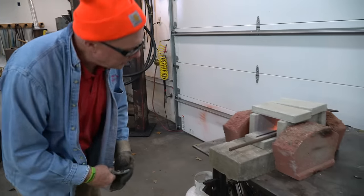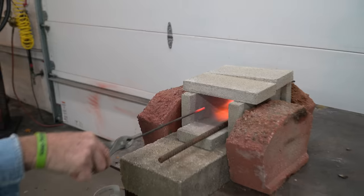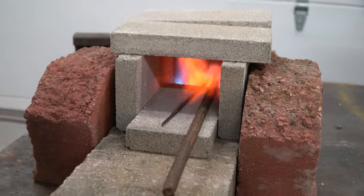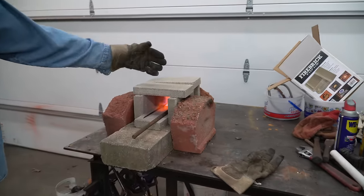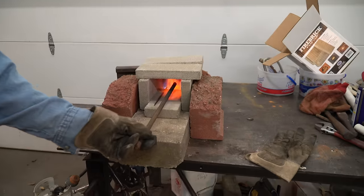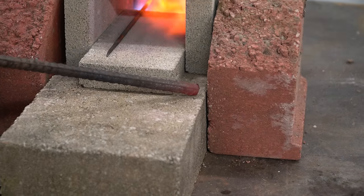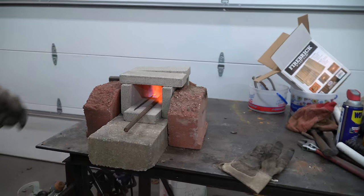Grab my gloves. They were already making red — that's workable right there. That heat's going to start moving out. We've just got heat right over the flame right now, but as soon as these stones warm up, they'll start moving that heat out and the whole thing will start glowing in there. Pretty awesome. The rebar's going to take quite a bit — it's a dull red right now, but it will heat up. The hairdryer's what's making it work.